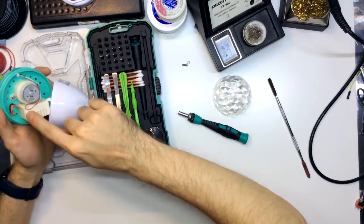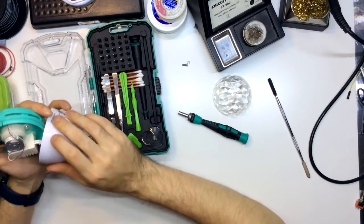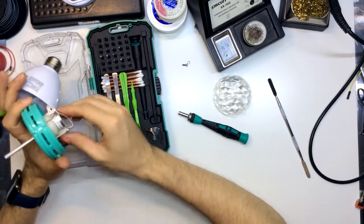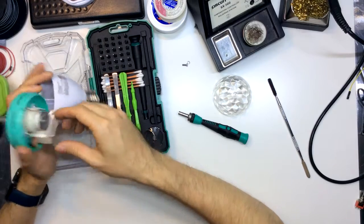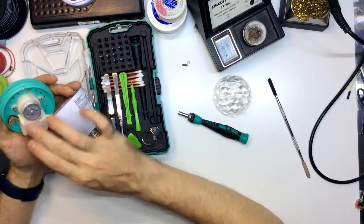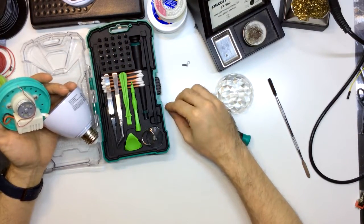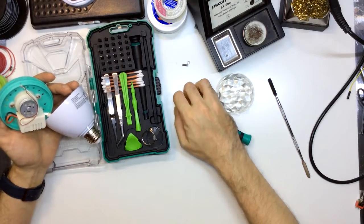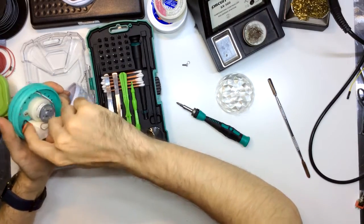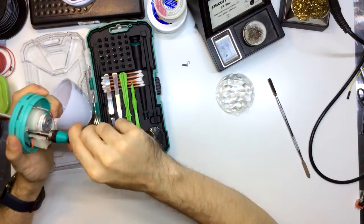This is actually pretty neat. I was expecting there to just be a simple capacitive dropper of some sort in the circuit here. You know, maybe some messily rectified DC, but it looks like it's got a proper constant current driver, which is neat. We'll have to take that apart and see what's inside. It looks like it'll be fairly challenging because there's a big mess of silicone goop right there.